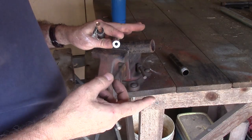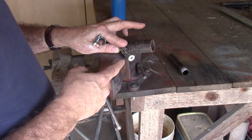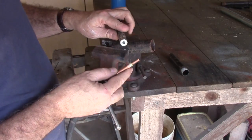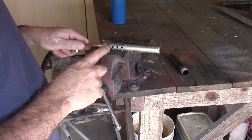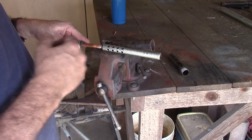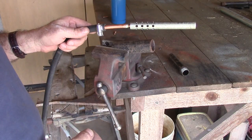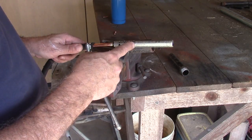I soldered a piece of brass on the end, drilled it out, and tapped it to quarter-28. Then I turned down a piece of aluminum on the metal lathe and shoved it up in the end — you could use a drill press and file it down, or even put a piece of wood in since this end doesn't get hot. I drilled a hole that fits, then slide it on. There are three-sixteenths holes, four of them, six rows, spread out about a half-inch apart. Gas comes in through the hose from a barbecue propane tank, mixes with air, and comes out the end.